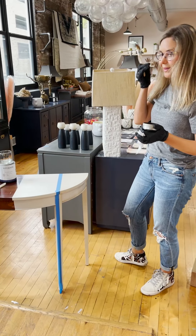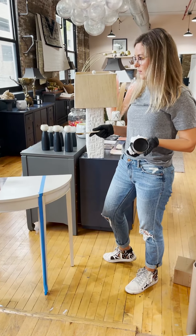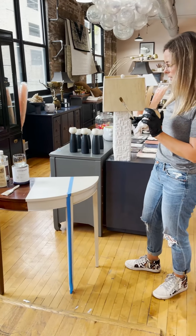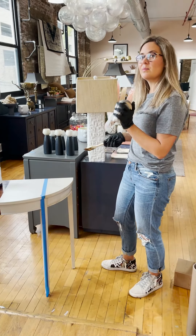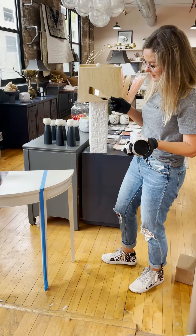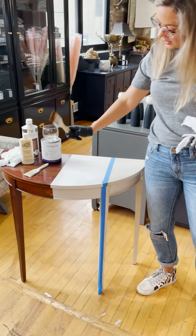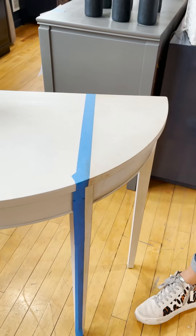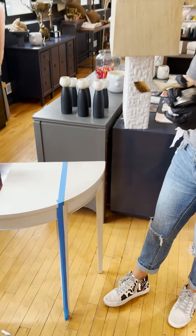I'm finished with the dark wax. I'm going to let it set for 24 hours, then come back over it with the clear beeswax, let that set for a few hours, and buff it out so the dark wax is trapped underneath. And there you go — there's before with just paint, and then there's also with the antique wax that gives it more of that vintage, glazed look.